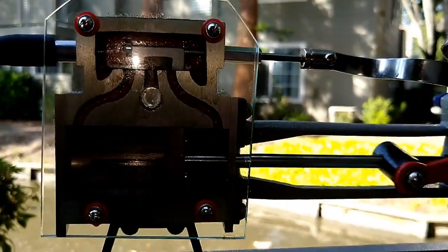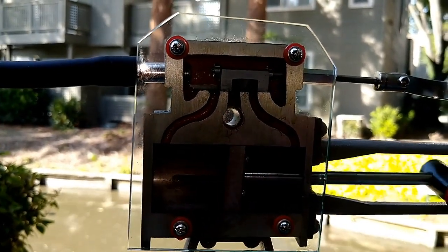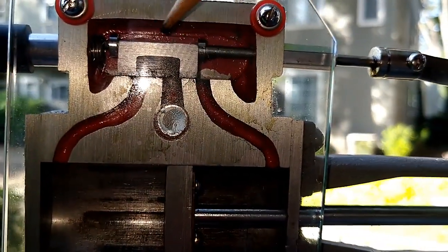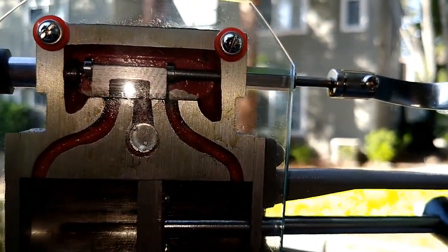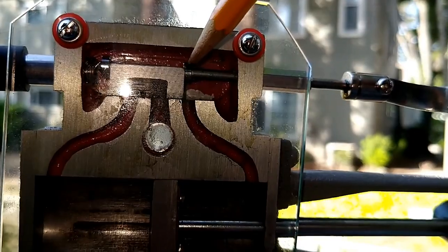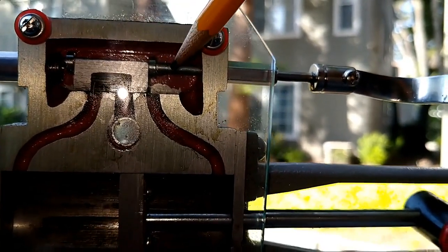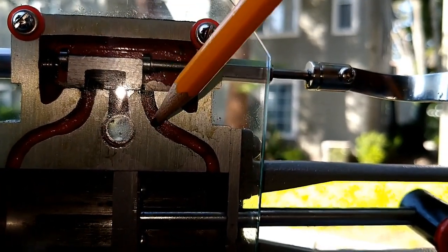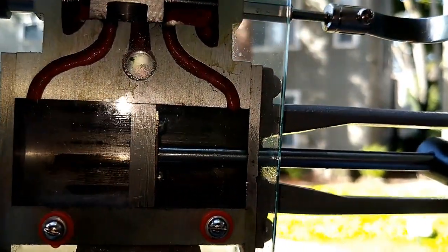You can see as I rotate it back and forth how the valve moves in relation to the piston. In this instance this is an outside admission valve - some locomotives are inside admission, some are outside. Typically with these valves they're inside admission but this model happens to be outside admission. So steam coming in at 300 psi from the boiler would fill this chamber and rush through this opening because the valve has just moved this way, coming down here on the back side of the piston and pushing the piston all the way to this end.